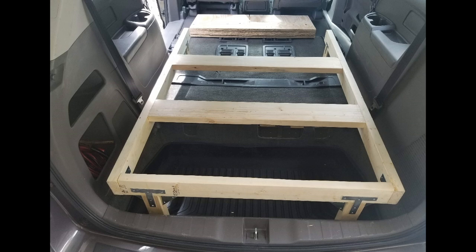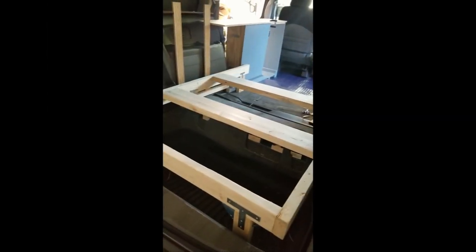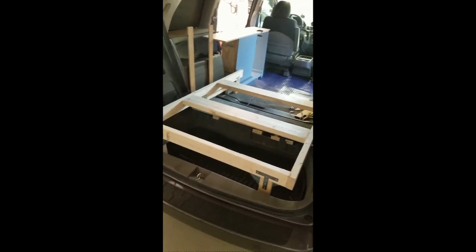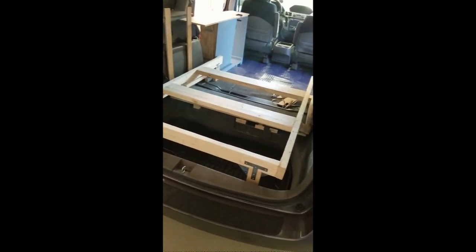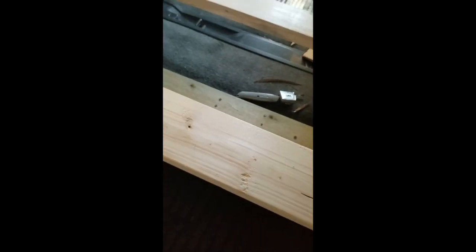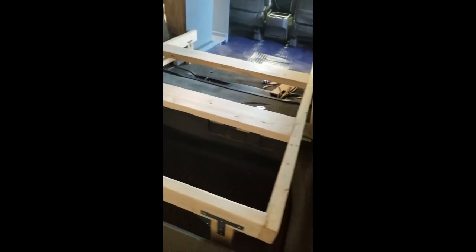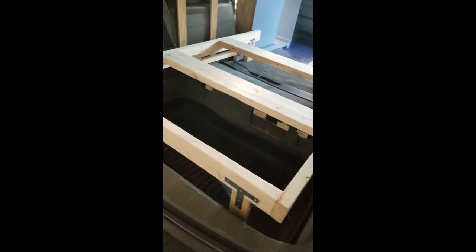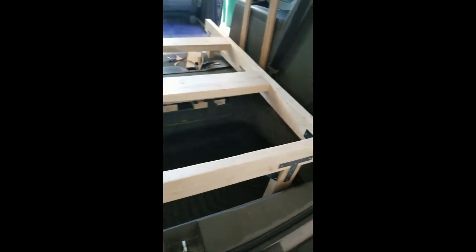Makes sense, right? One thing before the other, all in a logical order. So with the platform being made, I went ahead and started to construct the bed frame. The bed frame is made of two-by-fours with some two-by-sixes going across. This is where the hinge points hit and I wanted some support for those weak areas. I used a series of right-angle braces, T-braces, and corner braces. It was a matter of trial and error, seeing what feels really sturdy — and now it feels super sturdy.